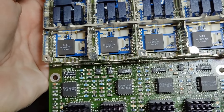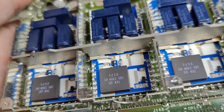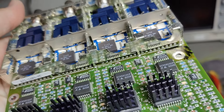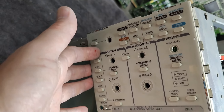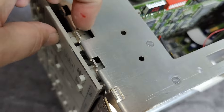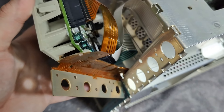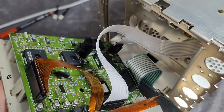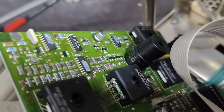Out comes the entire input board. This is the fantastic thick-film input board with amplifier and all that — this is the amplifier part. In the front we've got all the relays for the different ranges. The entire right front-panel assembly comes out in one go: there's a little plastic hinge — you push it and it hinges out, with two little plastic tabs that grab. Now I need to be really careful with all those flat cables. And the reason I want to go in here is that there's more nastiness — more capacitors. This board also needs some deep, deep fixing.